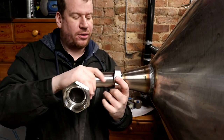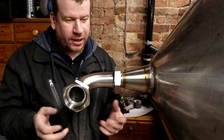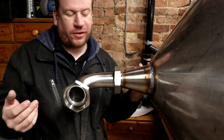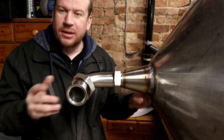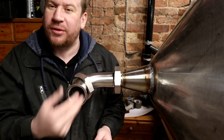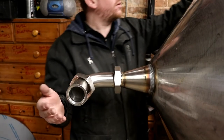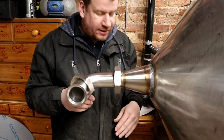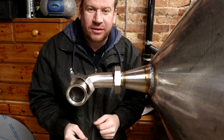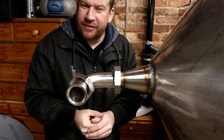I'm not going to have them as high as I did before at IVB because they were so tall it made the tanks nearly 4.2 metres high. I mean, I'm not holding 2000 litres in this - it's closer to 600 - so if it can't come out of a two inch outlet, what's it doing in the tank? You could get a golf ball through here. I'm going to measure from where I want the tank legs to start to where I anticipate they'll finish, and we might cut some three inch tube and tack some legs on to have a look. I'm just playing here a little bit just to pass an hour.